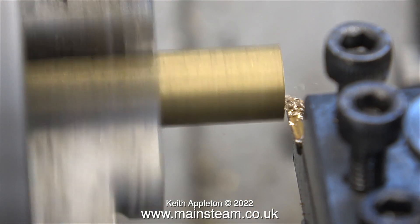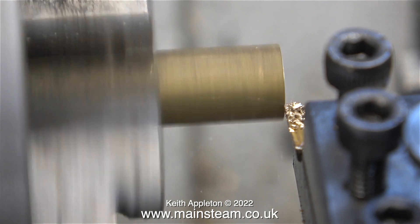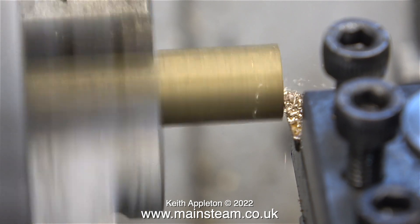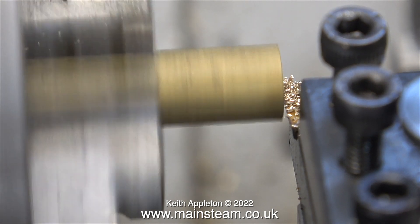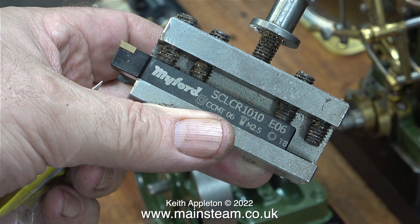When I fit this into the Chinese tool holder it's at perfect centre height now, and this tool is virtually identical to the one that I bought from Myford. The solution is very simple: the new Myford carbide tip tool is now fitted into the Boxford, and the tool that was in the Boxford - that's part of a set - is now fitted to the Myford. At first I thought the tool holders were different sizes but that's not right. It turns out this is the wrong cutting tool for a Myford tool holder - this one is ten millimetres square. But all's well that ends well because this is perfect for my Boxford, and the other one, now just ground down slightly, is perfect for Myford.